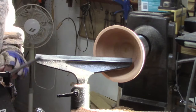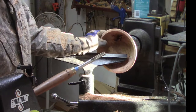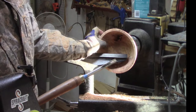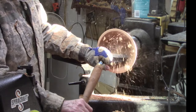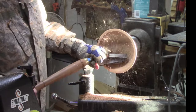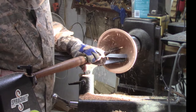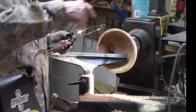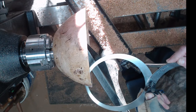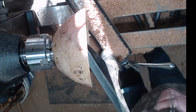Let's see if I can cut some of this across the bottom with this gouge. It's about a 40-degree bevel — it's too hard to float across the bottom, so let me get another gouge. I'm going to use this 'bottom feeder' to see if I can do a little better at the bottom. Still needs a little thinning here. Let me check the thickness — I can see what the gap is. Looks good, looks good. Bring it around — looks good. I've got a very uniform thickness all the way, essentially almost to the bottom.